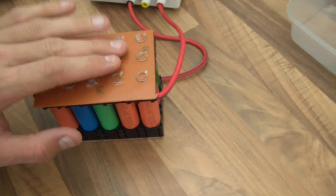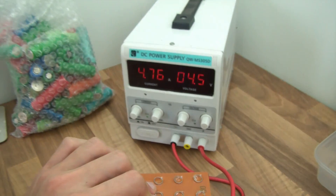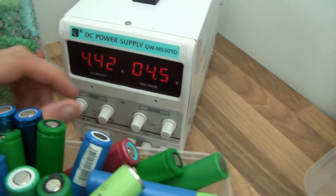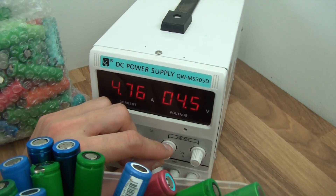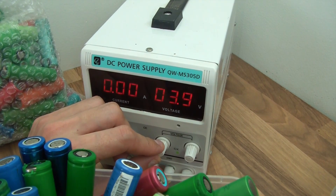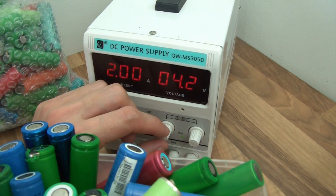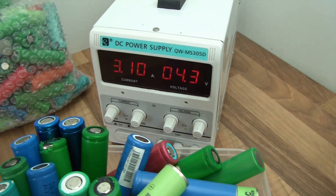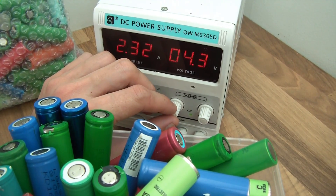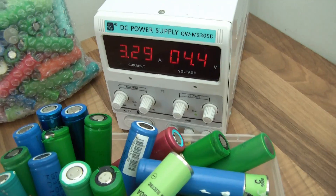You can see that it's contacted and it's drawing about one-point-something amps. If I press this down it'll try and draw more. So I'm going to change this down now — I don't want 4.5 volts. From my experience that's just a little bit too much. You can see that these ones are already charged — they've not drawn anything. What we want is something like 4.4 or 4.3. We want the cell voltage to reach 4.2 volts, but to get to 4.2 you have to charge it slightly higher than 4.2.